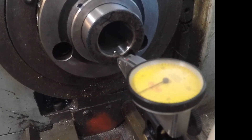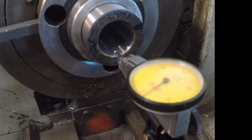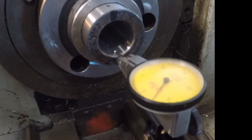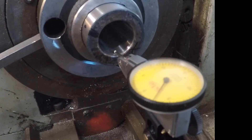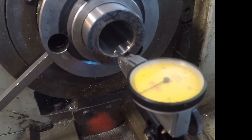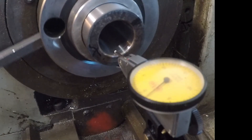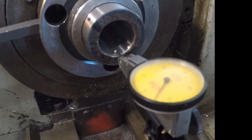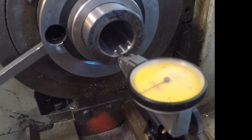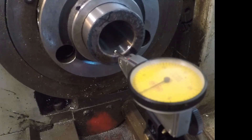I've been playing with it off camera. Looks like we're moving up — this would be a low spot, just shy of three thousandths. I'm not the first person to notice this; there were folks far more skilled than me. There's about a half thousandth where I think it's just stack-up or deflection of the gauge, but it's pretty repeatable. Bringing it around — just shy of three. This is a half-thousandth gauge resolution, and that's 360 degrees.